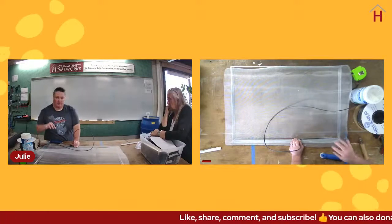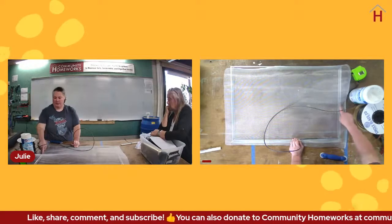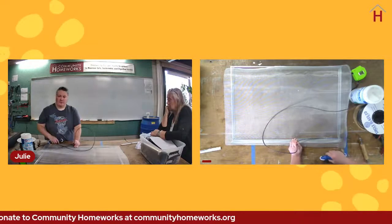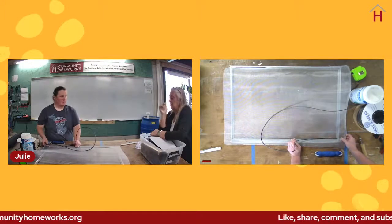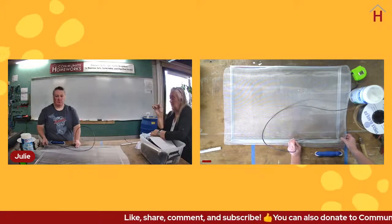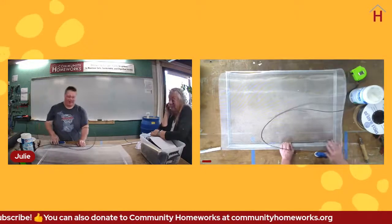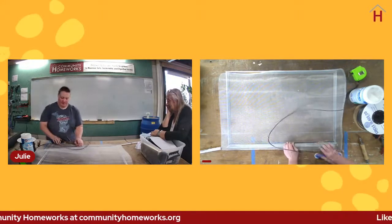Some wood screens and screen doors do actually have a spline channel that's almost routed into them or cut into them. And those I just typically would use spline the same as normal. So don't some of them also have, like, you have to take molding off and then get your screen off and then staple it back down and then put the molding back? Yeah, it's kind of its own whole class. If at some point you guys have demand for doing wooden screens, we can certainly do that because it is a more involved process.